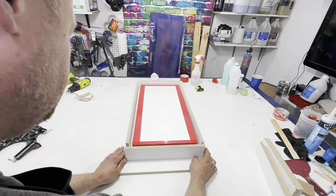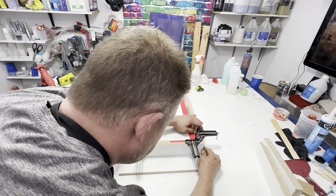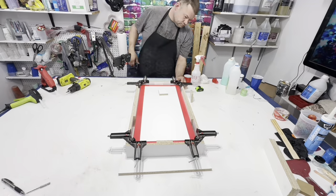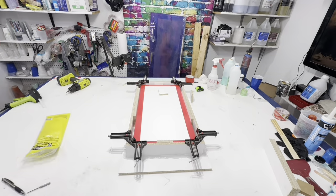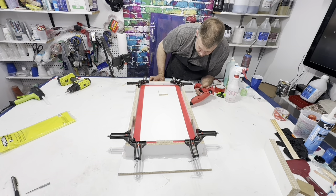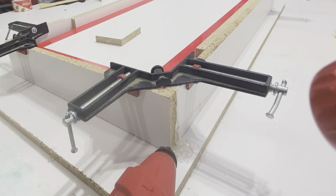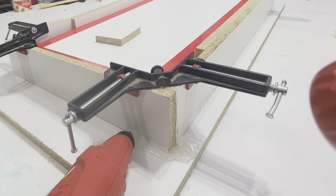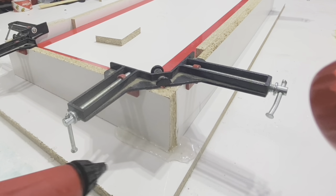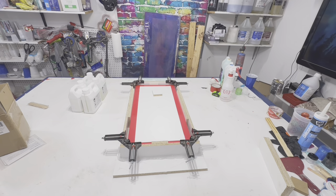I bring the drill in, pre-drill some holes, and run drywall screws down — about an inch, nothing fancy. Here I'm cleaning the sides and making the box around it. I've got these corner clamp things — I'll link them in the description — they're one of my favorite things to keep stuff square. I'm putting the half-inch shims around the block because that's where the silicone is going to go; we want a uniform half-inch all the way around. I just hot glue stuff down — I come about a quarter inch up on the lower melamine and let it drip down to seal it up. I've never been a fan of silicone caulk for sealing, I always just use hot glue.